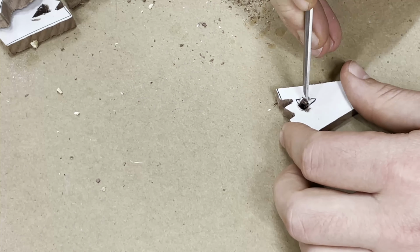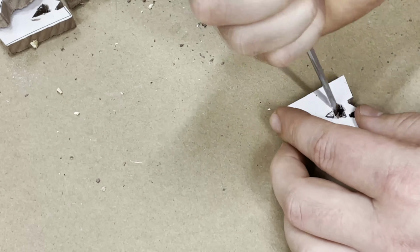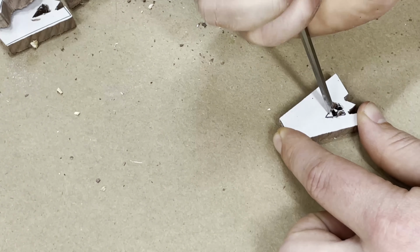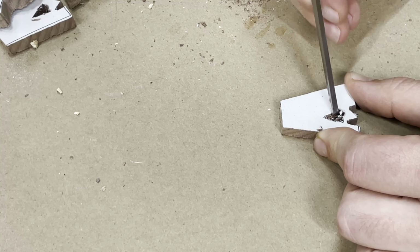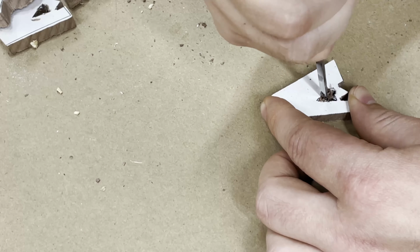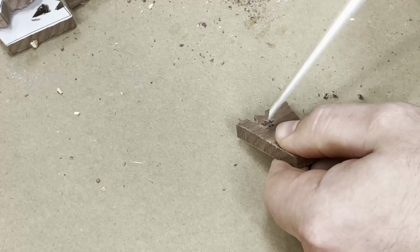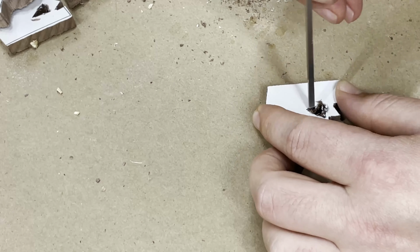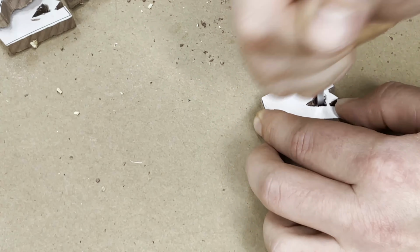I also use a chisel to get into those tight corners. It allows you to keep a nice straight edge. Same thing, this isn't the final procedure. There's some filing done to get those perfect edges on the inside. But this gets the bulk of the waste removed. And since the back won't be seen, you can undercut it to allow for easier sanding or filing.